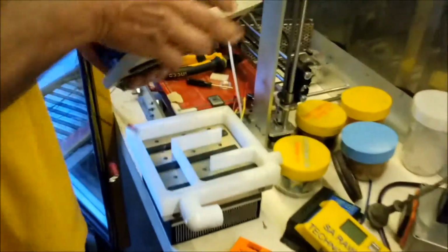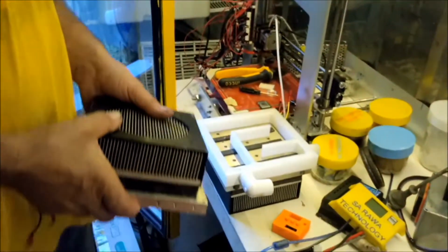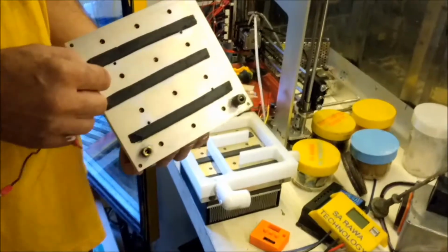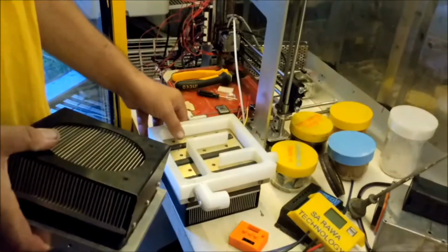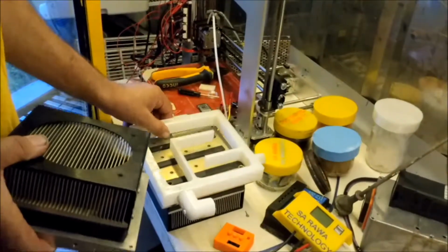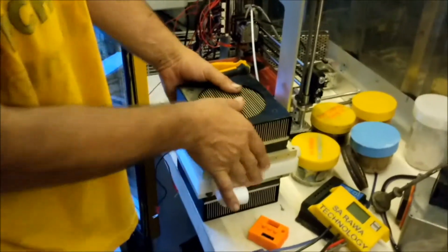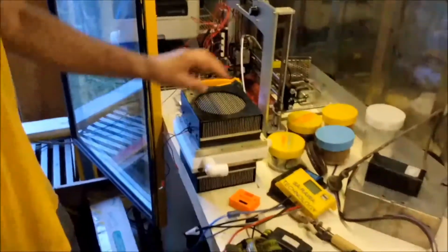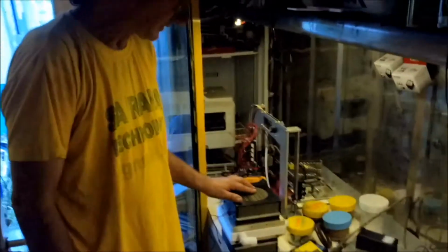We're having problems with the humidity, so this is a water-cooled Peltier cooling unit that was used for a large computer, but the original fittings require a positive pressure pump, which we don't have right now. So this frame here with the fittings is going to be sealed to these two aluminum blocks, and we'll just circulate cooling water through there and put this into a cabinet that's going to be sealed for storing the filament.